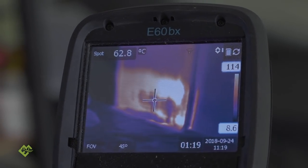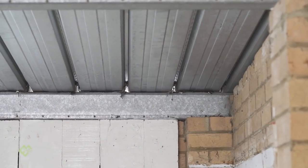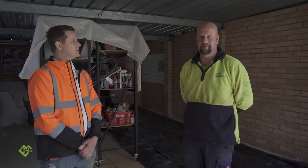Cool room panel, heating ductwork is only paper thin — it's foam, it's an airtight seal. In this situation you're obviously going to achieve a thermal barrier, but you're also going to achieve an air barrier. So we're going to sort of kill two birds with one stone.